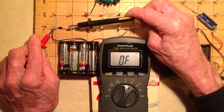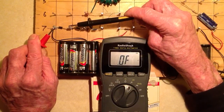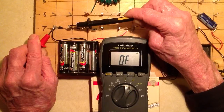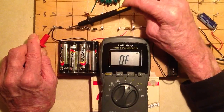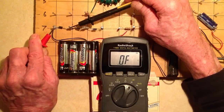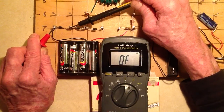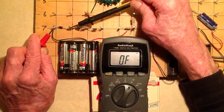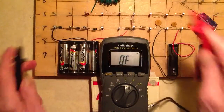You should get no voltage or no current flowing through this device with the red probe on the cathode and the black probe on the anode. Right now this meter is trying to force electrons through this diode from right to left, but it's not having any luck. Electrons come out of the black or negative probe and go into the red or positive probe. The polarity of the voltage at these probes is the same as the color codes indicate. Let's reverse these and see what we get.